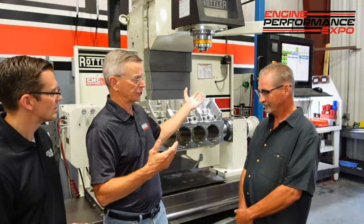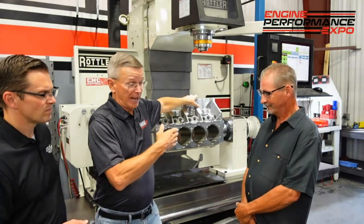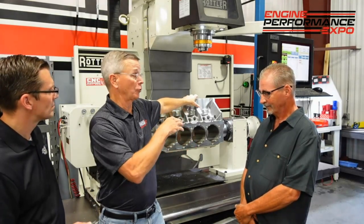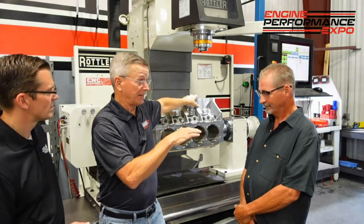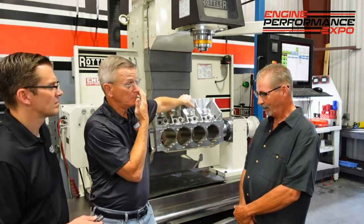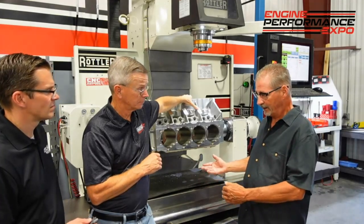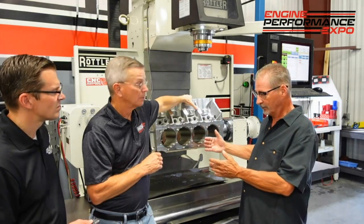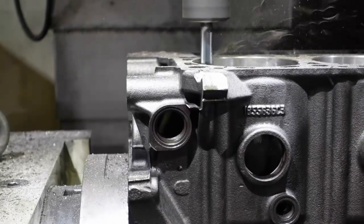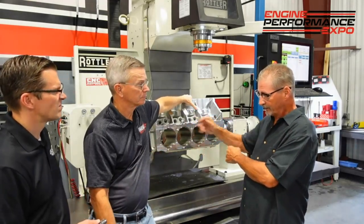Running from the seat of my pants, I've always been told you leave the feed rate where it's at and cut your RPM in half. So if I'm running 900 RPM on a cast iron block at 6 thousandths per revolution feed rate, I'm going to leave my feed rate at 6 thousandths per revolution but go to 450 RPM. As you pull that RPM back down, the amount of feed you're going into is going to change — you expect a better cut off of that. You're trying to blend to that difference, adjusting the loads on the cutter, holder, and insert.